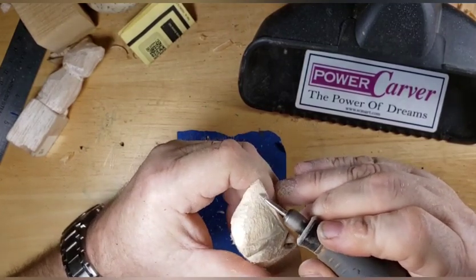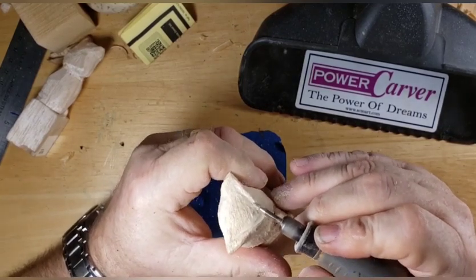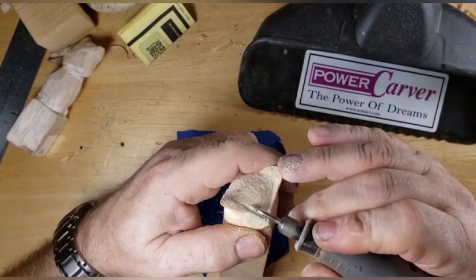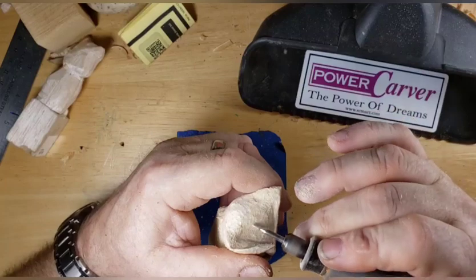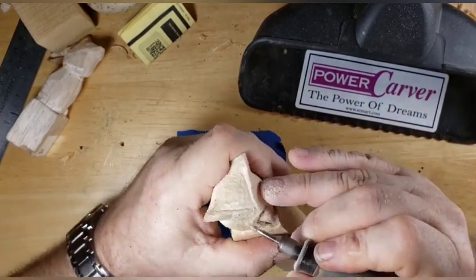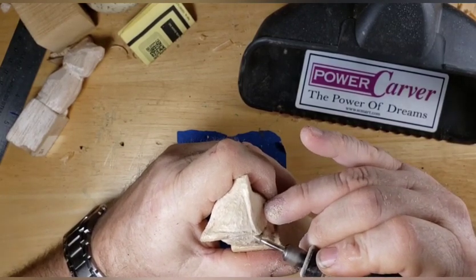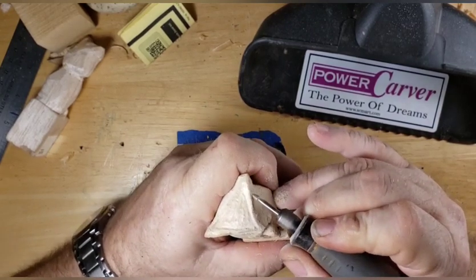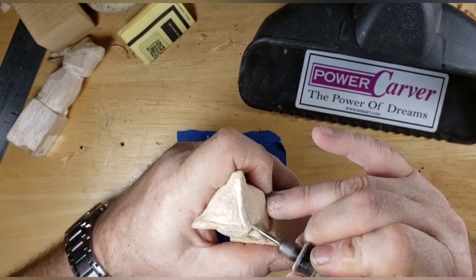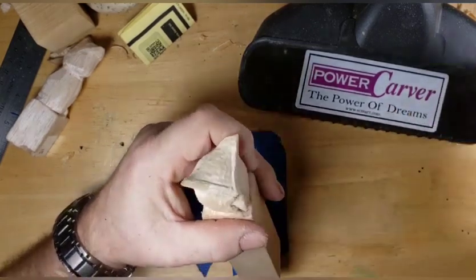When you're doing the beak - if you're going to put the undercut in where the beak hooks over a little bit, wait to do that till last. Because as you push that beak back if you want to shorten it up, and you've already cut the hook in the bottom of the beak, you're kind of stuck with what you've got as far as length goes. I would suggest cutting that hook in the beak be one of the last things you do on the face.